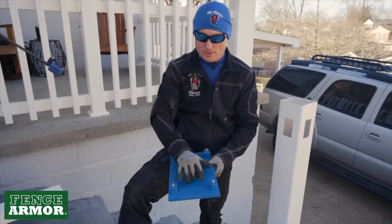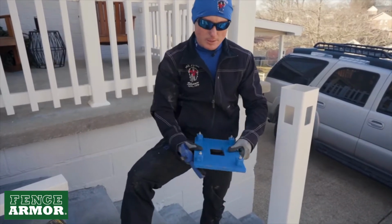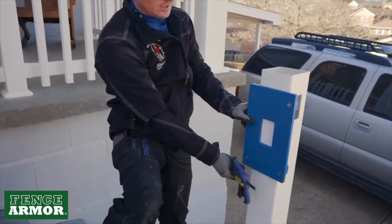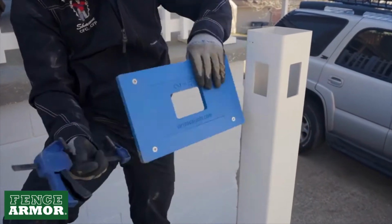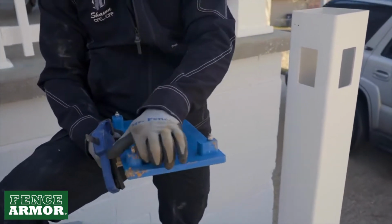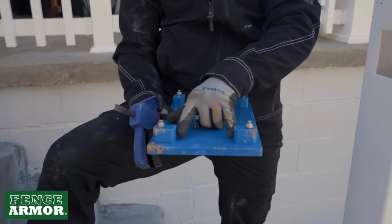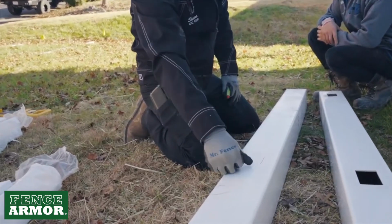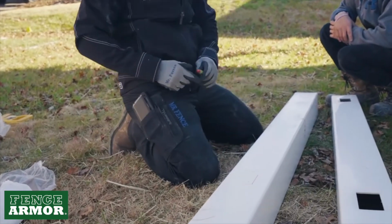Turn these brackets vertical and it gives you a 5-inch opening, which means it'll fit snugly on a 5-inch post. Centered on there, that's already centered. If we have 4-inch posts, we turn these horizontal and this will fit 4-inch posts and center itself. So this is all we're worried about, is this mark and this one, and the same thing in the top and bottom of that one.